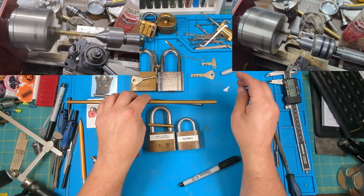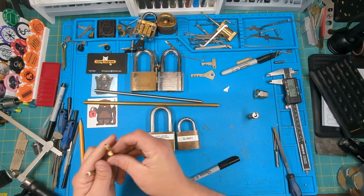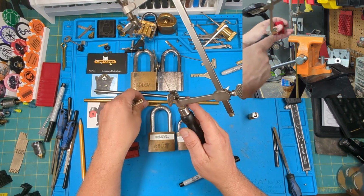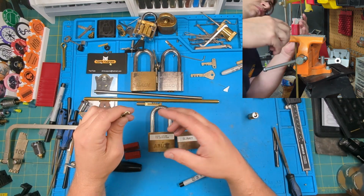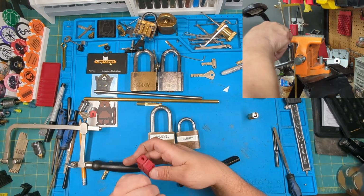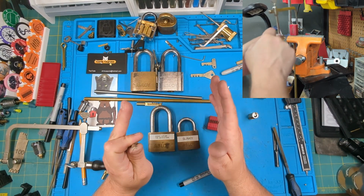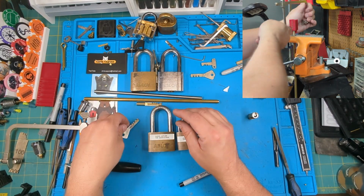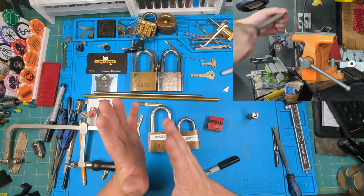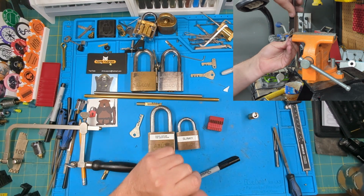Your next step is to cut it in half, because of the way the profile is. When I did this key, I did it with a jeweler's saw, cutting the center by eye. I thought maybe I could make a little jig with my 3D printer to help me cut it. But these are plastic, and that saw will cut plastic, so if the blade decides to deviate, it's going to cut the jig. I tried that and it didn't work out as well. So I just recommend cutting it by eye. Once you get this or tubing, cut it by eye. You can cut it to one side, so you can come back and file it down to the half diameter, 3.7 millimeters, half the diameter.